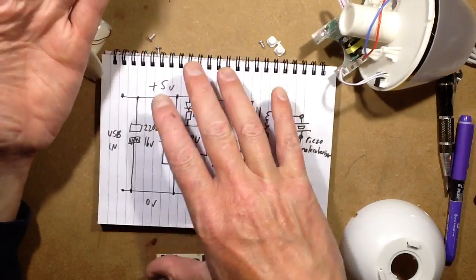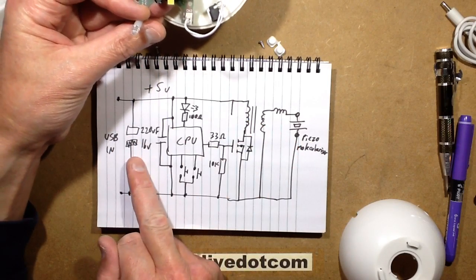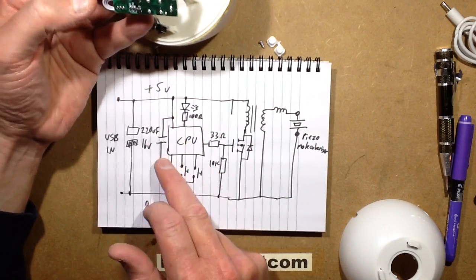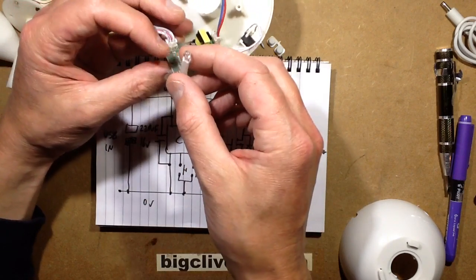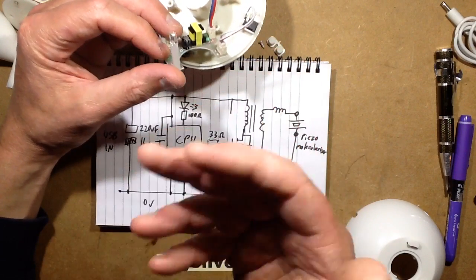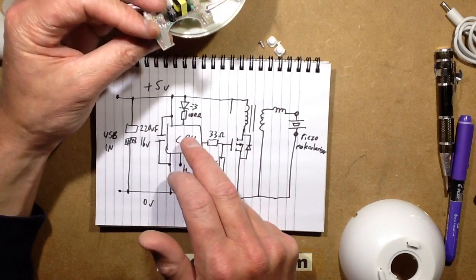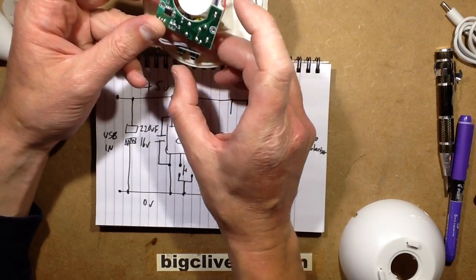The circuitry has no great surprises. The USB power supply comes in on this lead, then goes to a 220µF 16V capacitor, and from there it goes pretty much straight to the little 8-pin processor with a 100nF decoupling capacitor across it. The LED — the color-changing LED — is just a single 2-pin LED with that fixed color-changing sequence: red, green, blue, cyan, magenta, yellow, white. It's connected to one of the CPU pins from the positive through a 100 ohm resistor. When you press the button to turn it on, it's a momentary-action button.